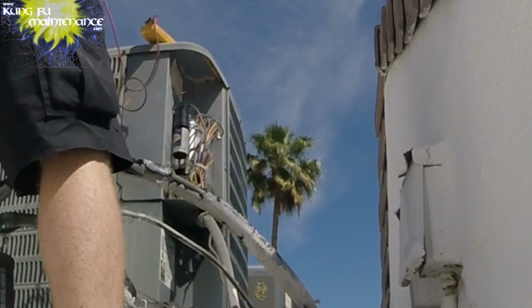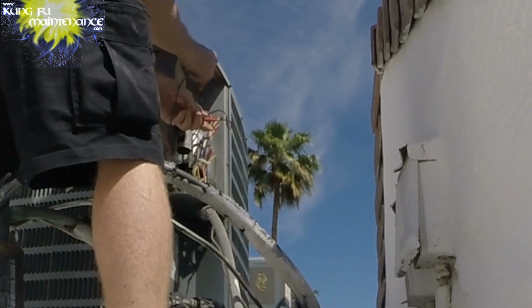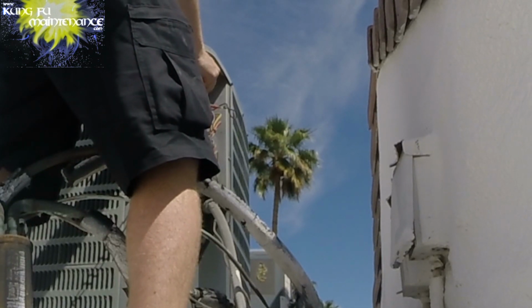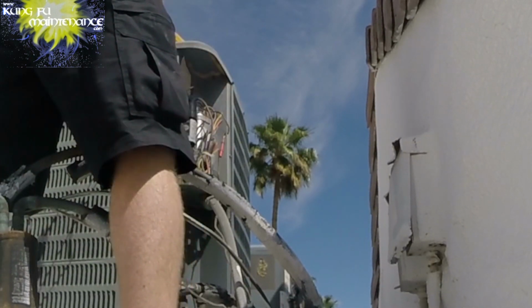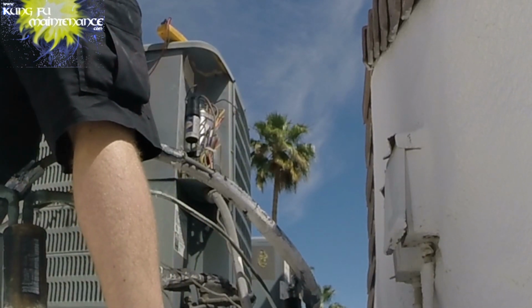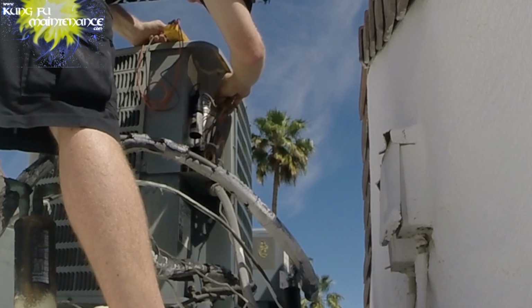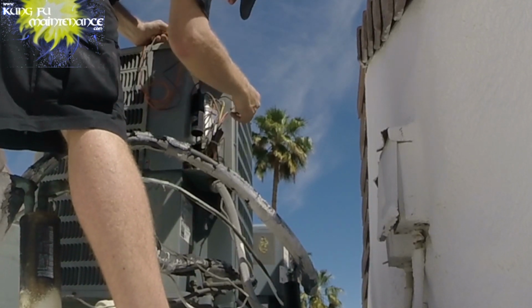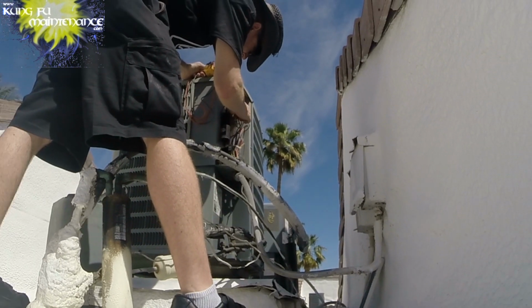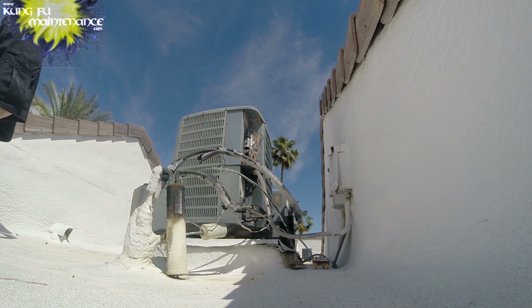Get a better feel on it. Hard start kit is 42.7. A little bit weaker, but I think I'm out of hard start kits. So I like to see these usually between 45 and 50. You need a new hard start kit on another unit. Let me just see if I have any hard start kits, because I don't want to keep leaving these undone.